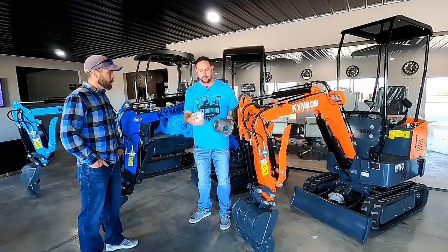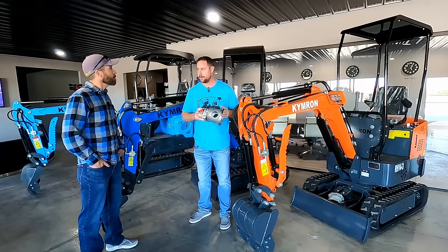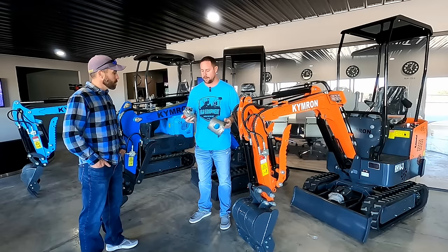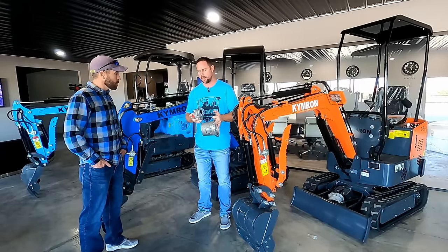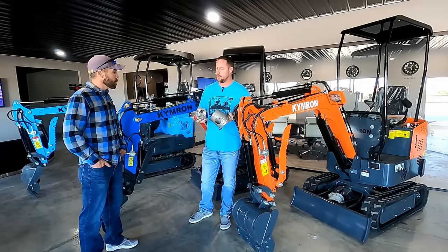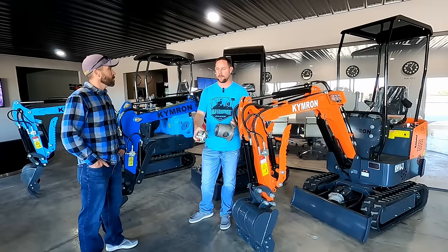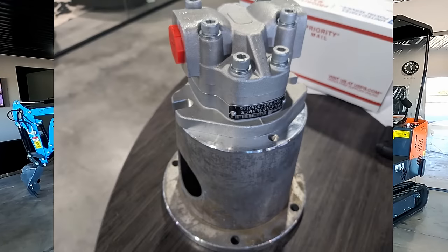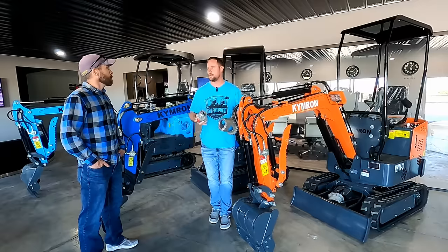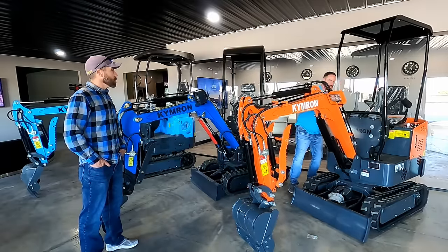This is a Parker pump. The Parker pump fits right in, bolts right up. Our pump fits right in, bolts right up — splines are the same. That's a big key, it splines in with the shaft on the motor. So right there alone you have parts interchangeability. You can go get a Parker pump and put it on there, or come back to us and get one of our pumps. Our pumps do about half a GPM more than the Parker.